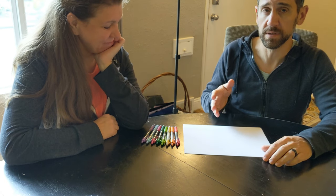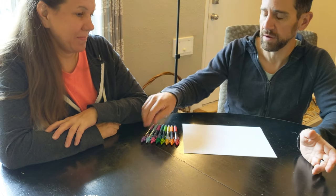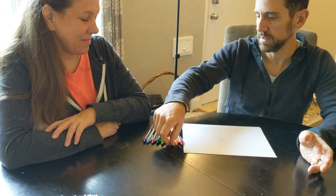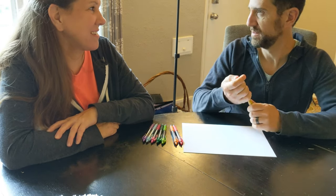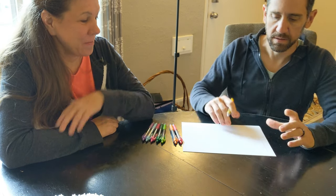Let's start with where our power comes in. For most people, your power comes in from the electrical grid. Ours in the garage, since it's totally off-grid, is going to come in only from the sun. Those come from solar panels — we'll make them yellow because that's the sun. We're going to draw a box that represents our array of solar panels. In a drawing, they refer to that as PV, which stands for photovoltaic — it's converting photons, which is what the sun gives you, into voltage.